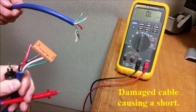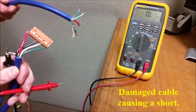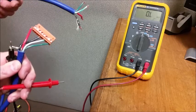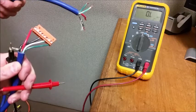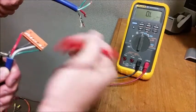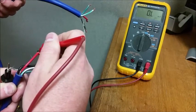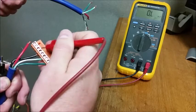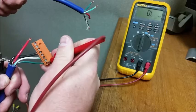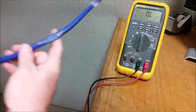All right, in this scenario, we're going to show a damaged cable and how it would look like a short. Usually to the shield is how you would find this. From a rock fall, the cable laying on the road and getting ran over multiple times. And what you're looking at right now is we're open circuit. Here's the end of the cable that we're talking about. And here's to the shield, to the power, the other power, one of the comms, the other comm. Everything's open. But you look at this damage,